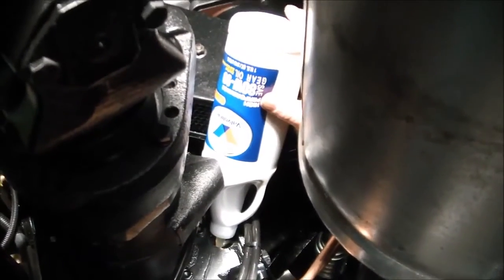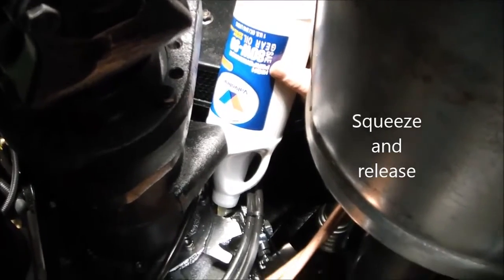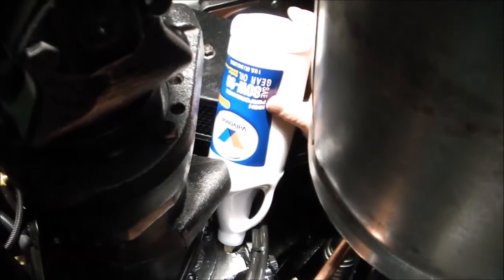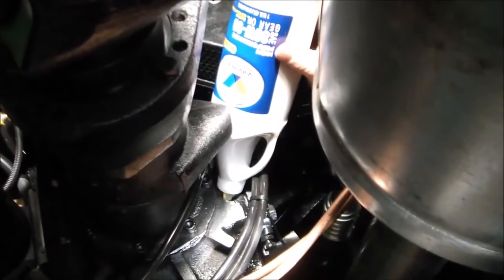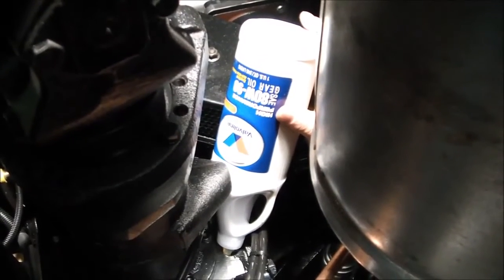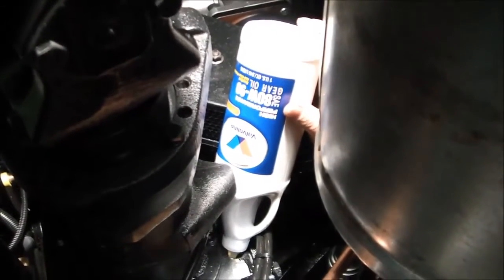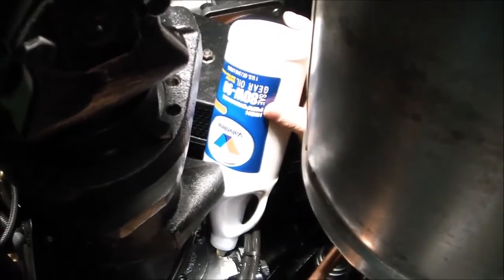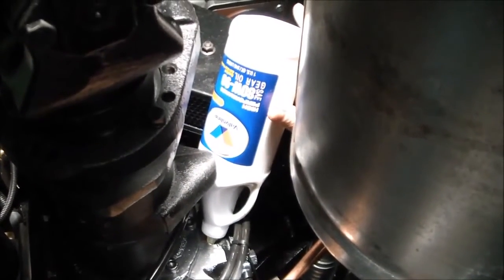This is probably the best method of working the gear lube from the bottle into the fill port. The first full quart — even if you lose a little bit, it's not a big deal. We don't need a full 2 quarts into the gear case — it's about 1.75 quarts. Use the first bottle and squirt the entire contents into the gear case. Then with the next bottle, our recommendation is to pour it into the empty bottle and only fill it up about three quarters full, so that you know exactly how much to put in.